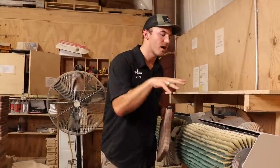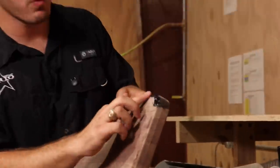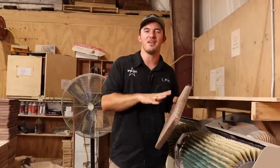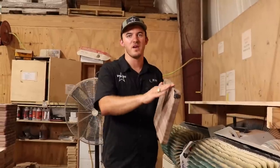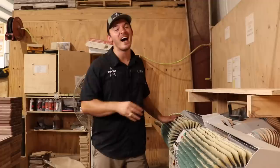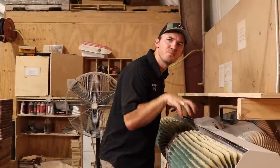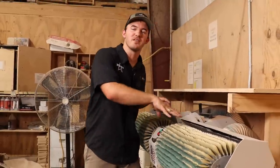As much as I love this sander, this is not an end-all be-all sander. We still have to do a lot of sanding work on particular stuff. Where we have epoxy filling, you're not going to put 80 grit on it and really haul down because it's going to round the edges. It will get all the little nitpicky stuff you don't want to do and save a ton of time, but it won't handle thick material or super rough edges with tear-out. Also, replacing all this sandpaper is not cheap — it is pretty pricey, though we only have to do it once or twice a year.